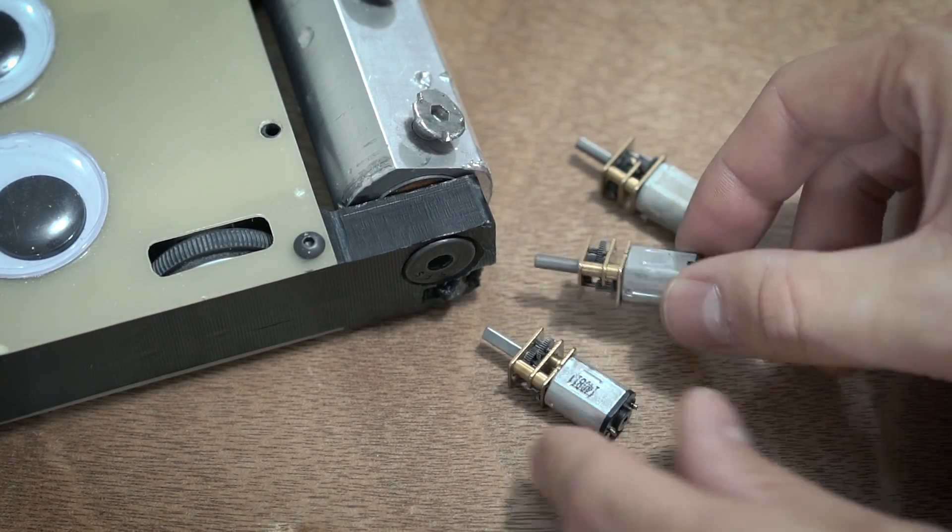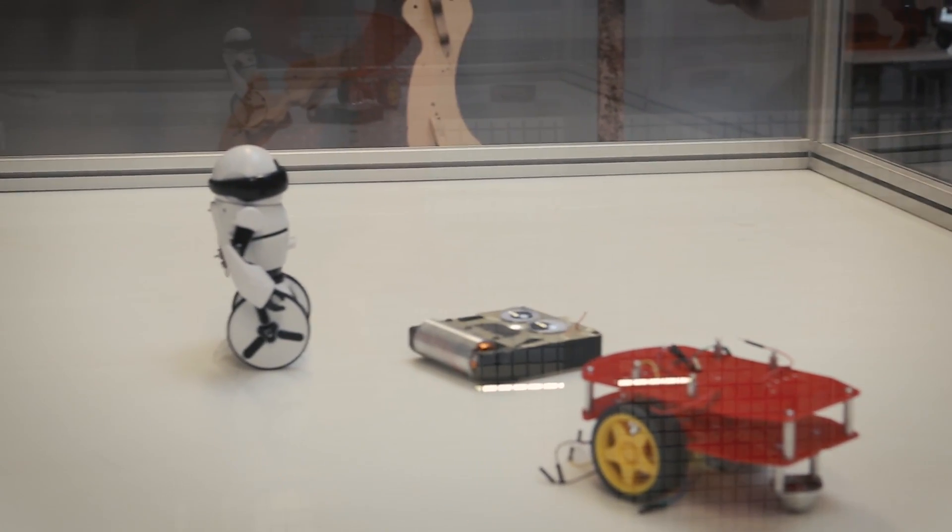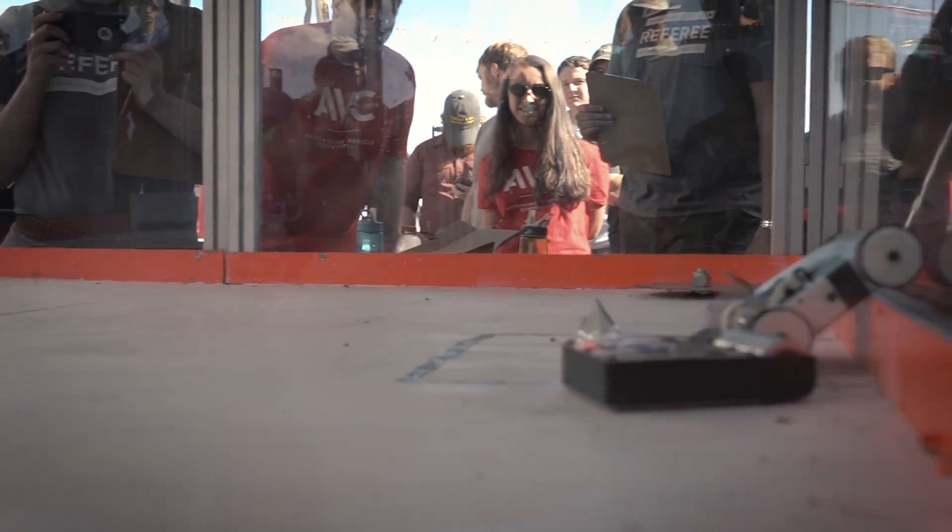Now that the motor mounts are fixed, I need to choose a different motor. I'm using micro gear motors from Servo City — they've performed really well, but the RPM range really isn't that great. I was using a 50 to 1, which is a 460 RPM motor, and it was just way too slow. So I stepped up to these 30 to 1 ratio motors, which are 900 RPM, and it was a game changer. I went from being a relatively slow robot to actually being one of the faster ones in the competition — you can actually hear people in the audience saying 'oh wow, he's really fast.' These little motors are fantastic: about 100 milliamps idle current and 1.6 amp stall current, so they work perfectly with the Fingertech tiny ESCs. I got these for like 10 bucks at Servo City — highly recommend them for drive motors.